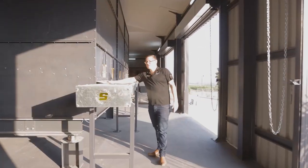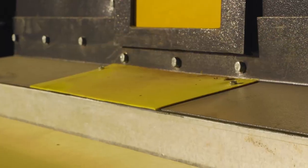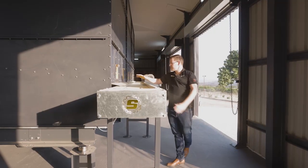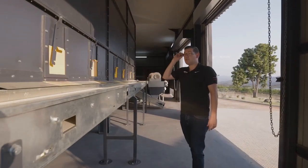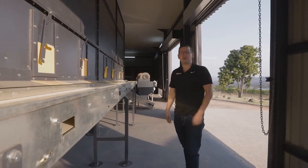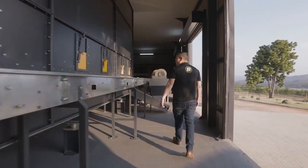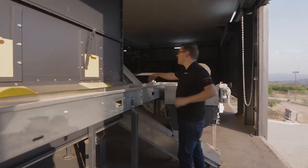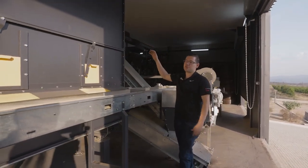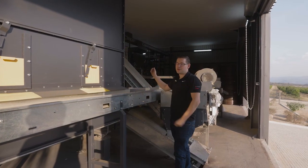This conveyor has little soft drops, because these are now drier nuts, more susceptible to damage. Soft drops, outfeed conveyor, 16 ton per hour. So you can load an 8-ton load in half an hour. You can also, in this area over here, take this bin and send the nuts into the drying room. So you can choose smalls to the truck or smalls to the drying room.